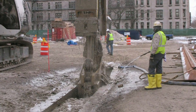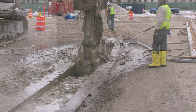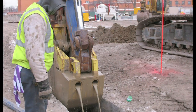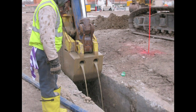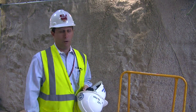In the process of digging out for a slurry wall, we have a 30-inch bucket that's dug all the way around the perimeter. And as we're digging out, to prevent the earth from caving in on the backside, we're pumping in a liquid bentonite material, which is a slurry mix. The slurry is made of an elasticity material that allows the hole to be filled up without caving in.